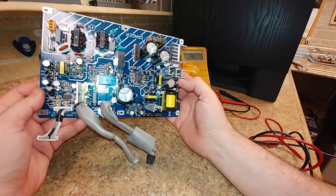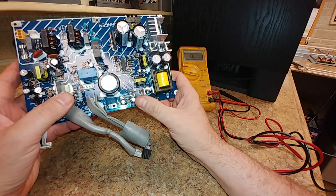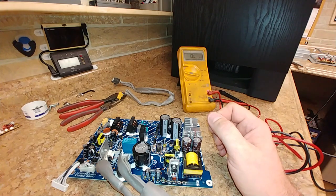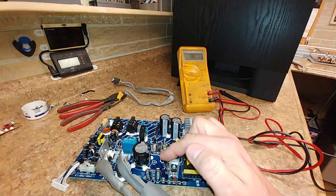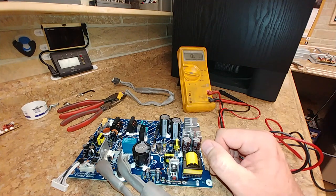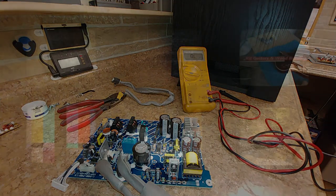So this is going to be a continued video — I have to download the service manual and order parts. That's all I have for now. Basically, this area right here with the diodes, resistors, and discolored capacitor is what's failing, and I've got to figure out why. I'll be back with more info. I have to order parts first — I don't have any diodes, I don't have this type of capacitor, and I don't have a 4.7 ohm at quarter watt resistor. I will be back with this to make sure the information gets out there for anybody else who has one of these subwoofers experiencing the same problem — it seems like a common issue with these units.